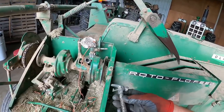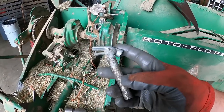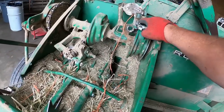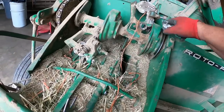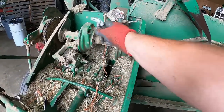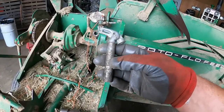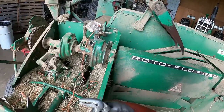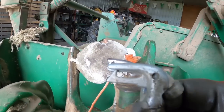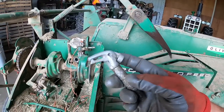So while I was looking for a twine arm and knives, I found I have a brand new bill hook. As long as I'm this far, there should be a roll pin in here somewhere under the dirt — like that, so it would be facing this way. Drive that out and swap this out. I'll keep that old bill hook — it was still working. But you can see the wear on that compared to a new one. Might as well use it.